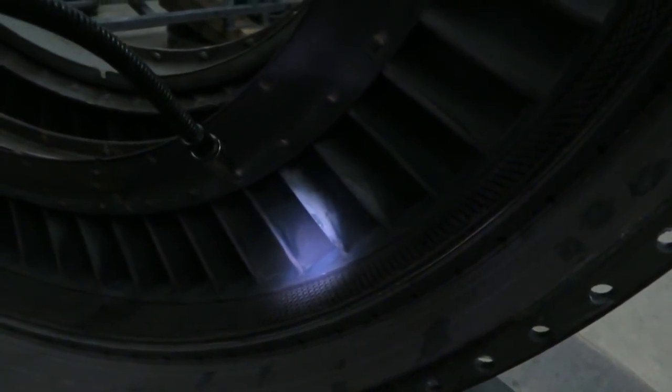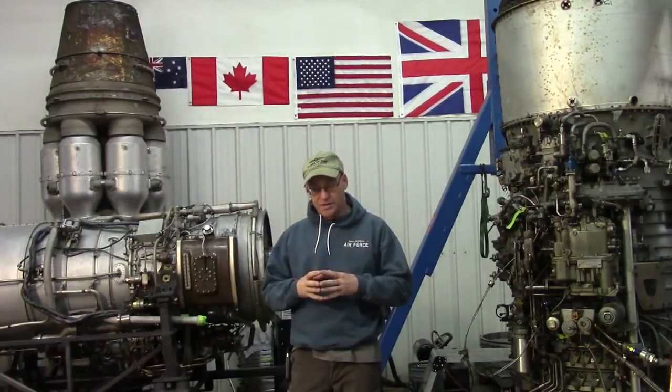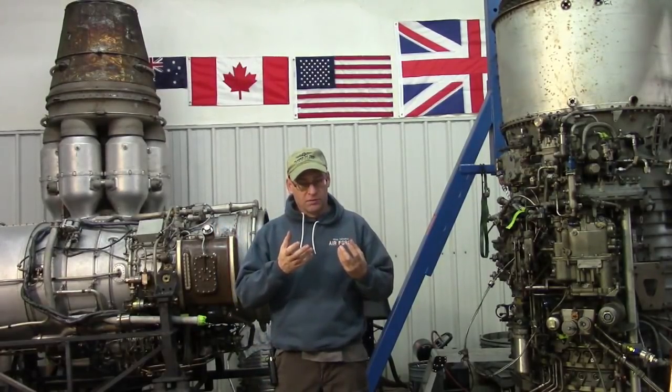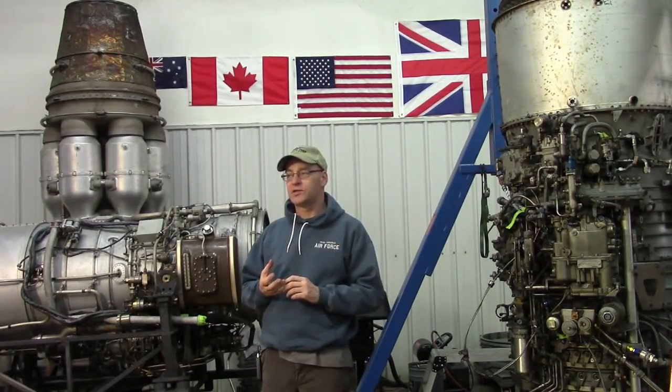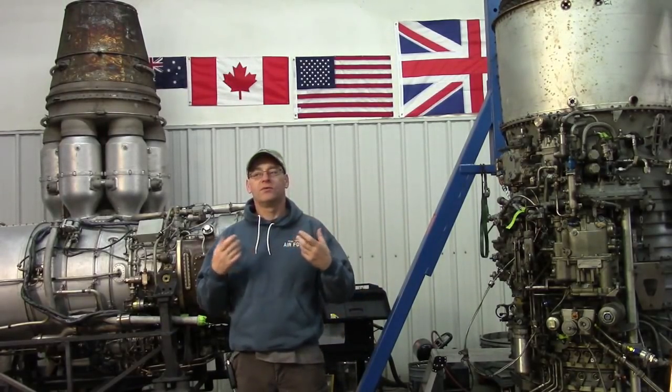That's the last of the compressor discharge air that is not used for combustion. Cooling air is a very ingeniously managed commodity in the engine — it's very valuable because all that work was done by the compressor to bring that air to 100 psi, 150 psi, 600 psi in some modern turbofan engines. It's very expensive air, so you want to minimize its use. With modern engines, one way they get more powerful is through better sealing, so less cooling air is drawn off. When you reduce the compressor output by tapping off for cooling air, you reduce the amount of power the engine can make.